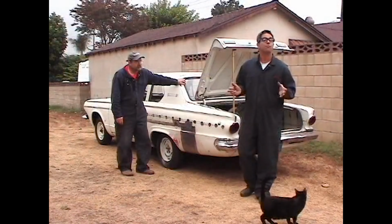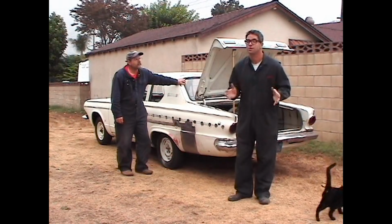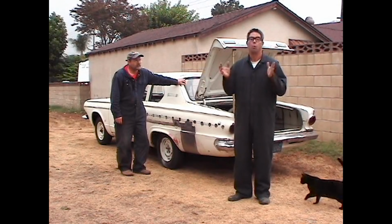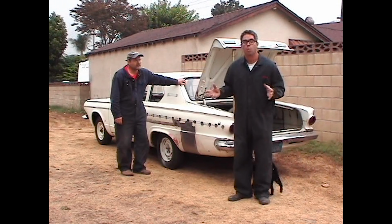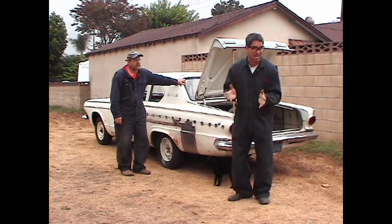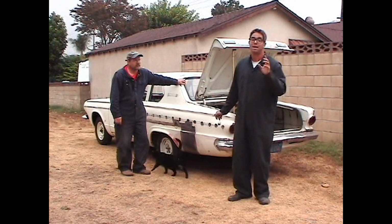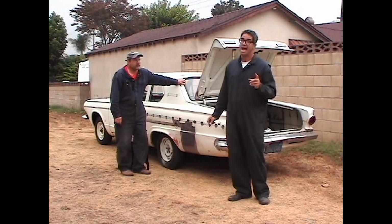Well, we're just about halfway through the process of converting our little Dodge Dart into an altered wheelbase match racer. We've moved the rear suspension 1 foot forward, reducing the overall wheelbase from 111 to 99 inches. The bodywork we're not going to do, we're just going to farm that out. But at the front of the car, there's still another half of the job to do.